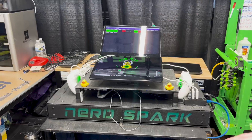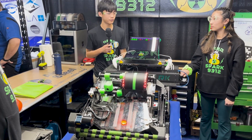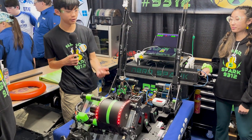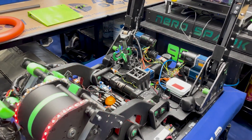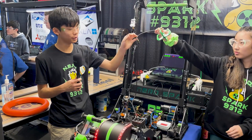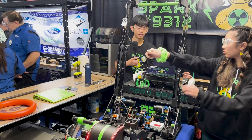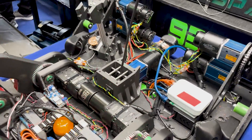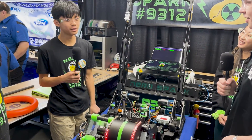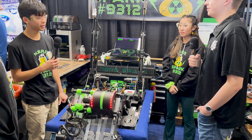Very cool, NerdSpark. I understand you have a grappling hook in your robot — somebody want to tell me a little bit more about that? So our grappling hook is for our climber. If you press this button, our robot moves outward and this grappling hook is able to shoot. The grappling hook shoots up and we have this rope pulled out to a certain length that will be able to reach over the chain but won't extend out of the frame perimeter. And then this winch — it's just a Falcon on a gearbox — winches all the way down to our base plate. Would you say that's pretty consistent? It's been a little bit off and on, but it's getting a lot more consistent. At week five it was about 20%, but I think it's been 70% here.